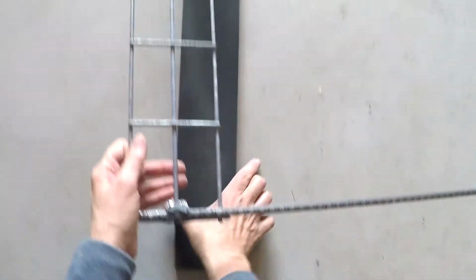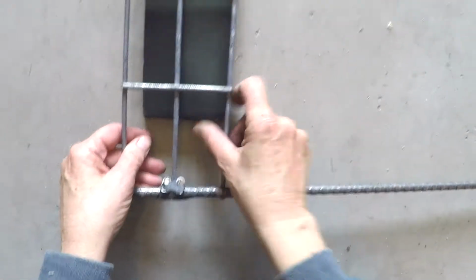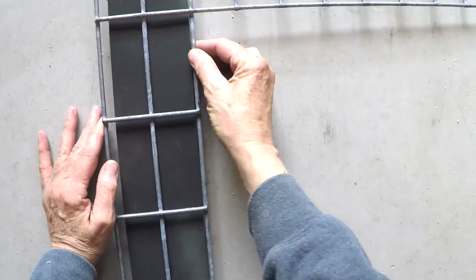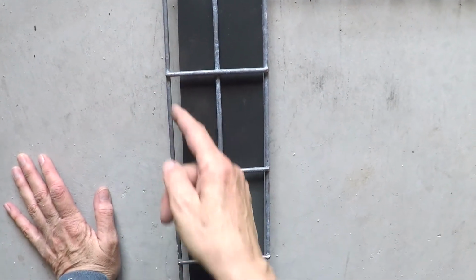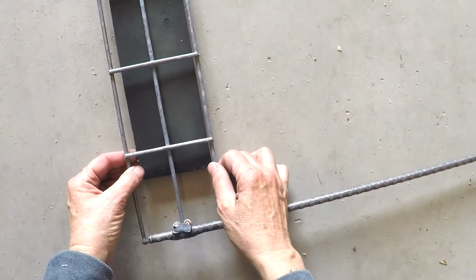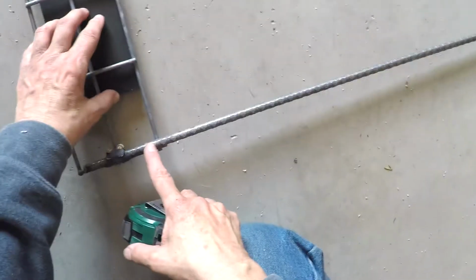So the first thing we want to do is to slide one of the 50-inch boards. Make sure you pick up a 50-inch board, and we're going to put it right underneath the left side of the frame. Now this board will go pretty much flush with this inside edge, okay? Don't get it too close over here. You want this gap because that's where you're going to put your spring clips to attach to the next panel over. In terms of height, we need to get a measurement right now because this is a fairly critical step right here. It determines how much gap we're going to have underneath the door.